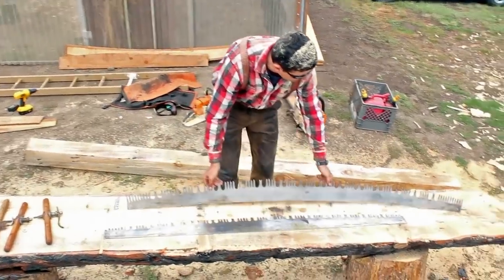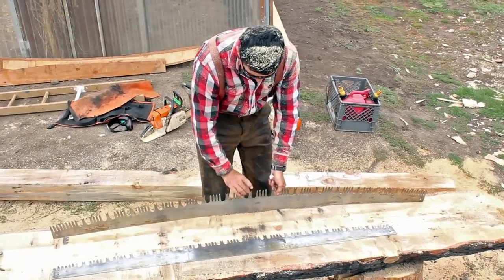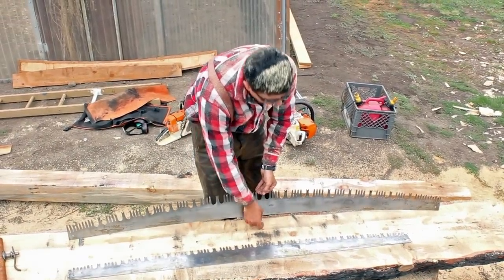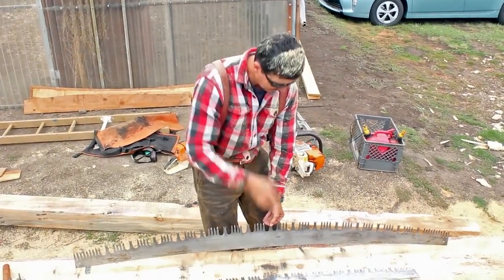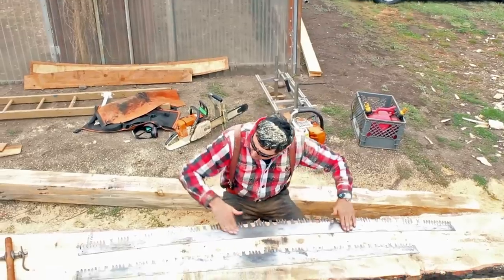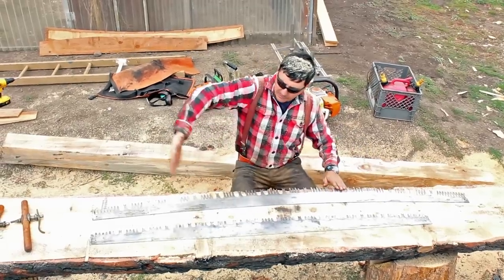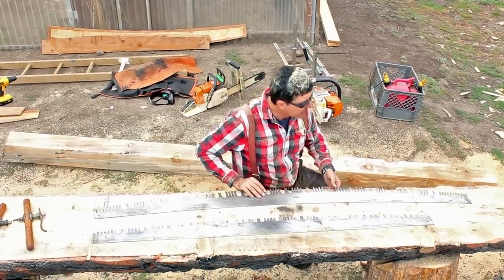What crescent ground means is that this Atkins 53 is thickest in the middle at the waist, and it tapers from the raker to the back five gauges — that's five thicknesses of sheet metal. Not only that, but it also tapers back to the points three gauges. So it is ground like a big circle.